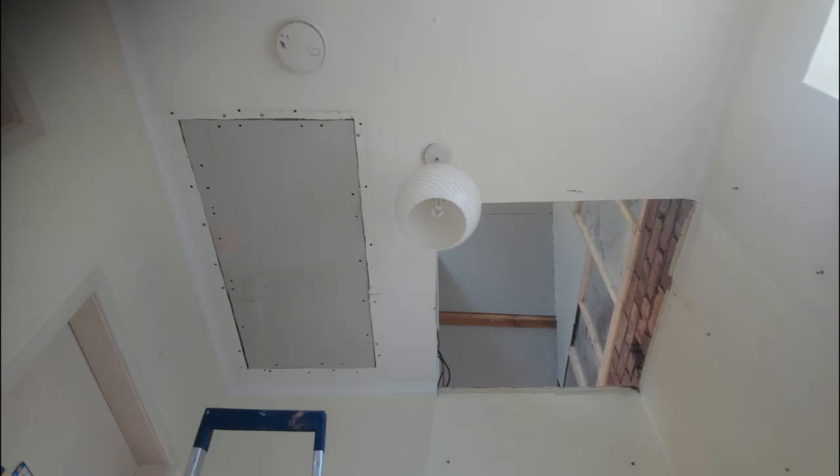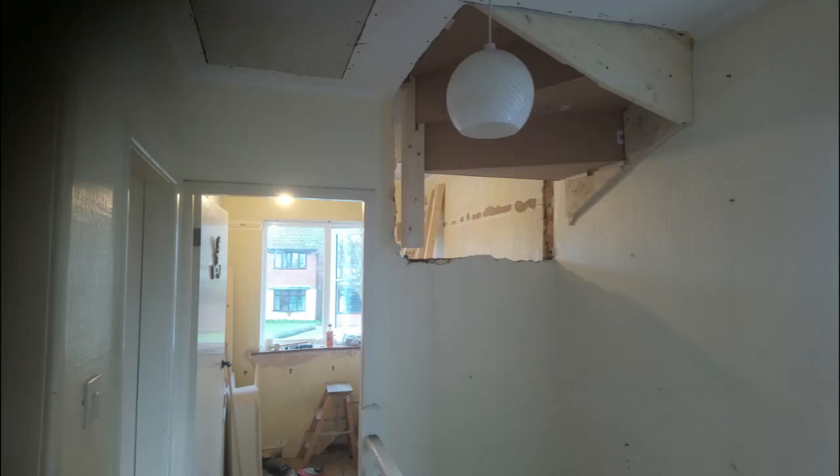You can see where the ceiling above the staircase hits that purlin, which I've had to sand back to a nice finish. I couldn't do the back bottom edge of it, so I made it so the ceiling runs down from the back corner of the purlin and you only see the two sides at an equal amount. Originally it was going to be a lot more exposed but the roof ended up with thicker insulation because of the rafter strengthening. I really like the idea of it being on show and I've copied that feature over the top of the bed headboard.